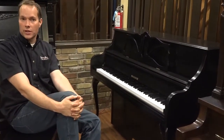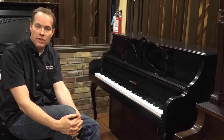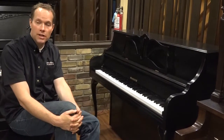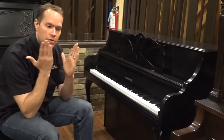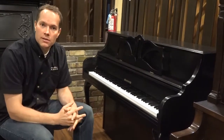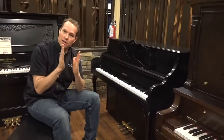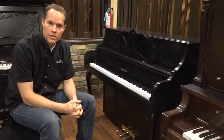From the standpoint of the guts, we've put it through the full assembly line that we have in the back shop. It's a very, very extensive, exhaustive checklist that we put these pianos through. So everything from reshaping the hammers, because after hitting the strings for years they get grooves and little dents in them. So that's been reshaped, so rather than a flat surface, it's back to just a rounded part of the hammer that's actually coming in contact with the string.